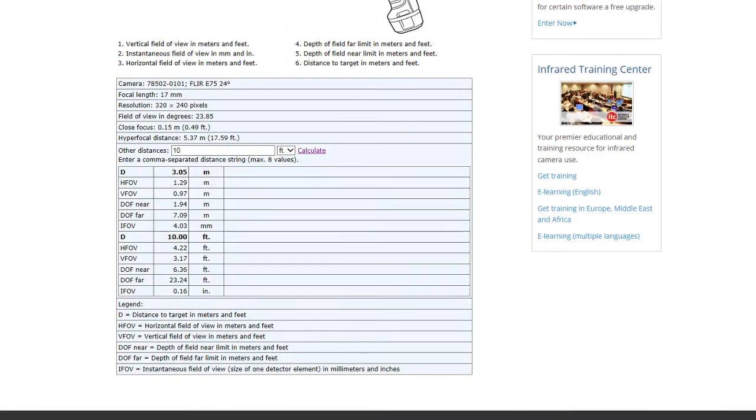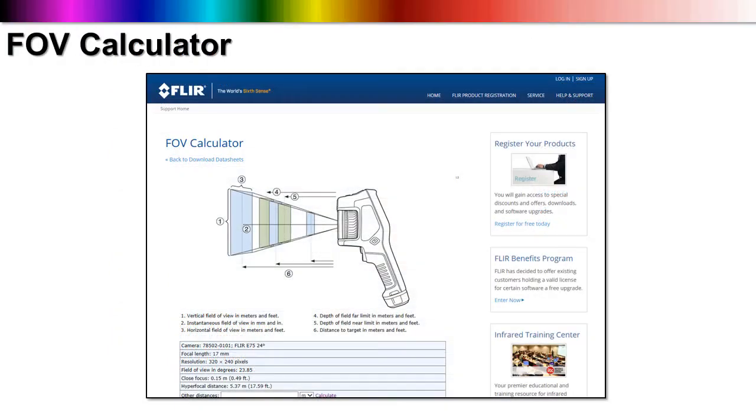It's important to note that this is strictly for detection. MFOV or measurement field of view is not provided. To get an estimate of what your MFOV might be, it's about three to four times the IFOV, depending on the type of camera that you're using. Of course, this doesn't account for issues of emissivity and other object parameters, but for spot size ratio, this field of view calculator is a great tool for thermographers to better understand the resolution capabilities of their thermal imager.